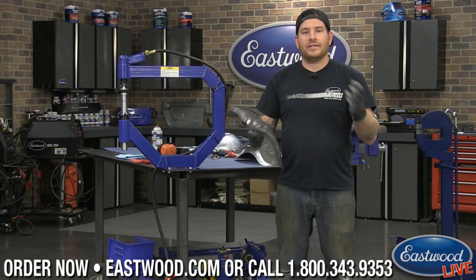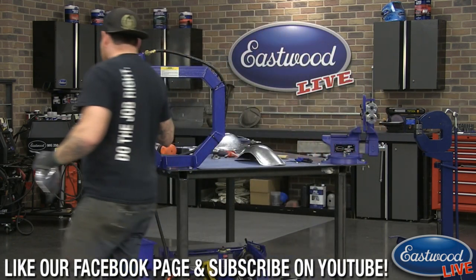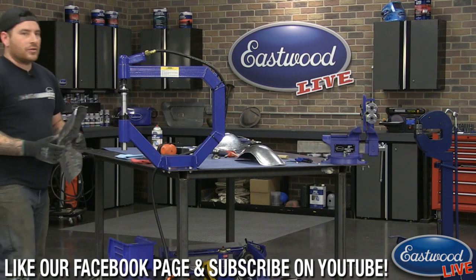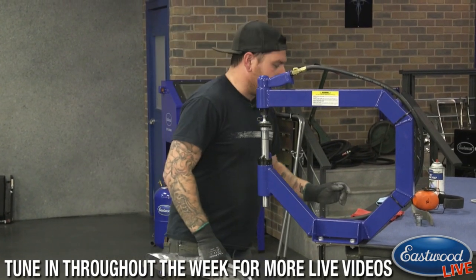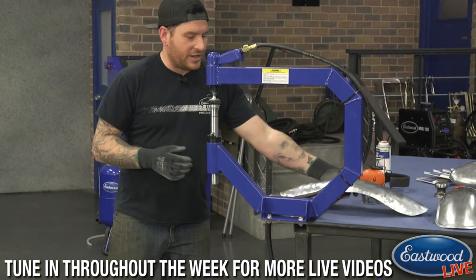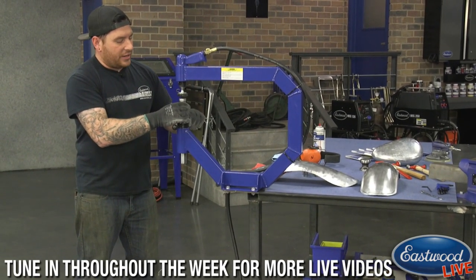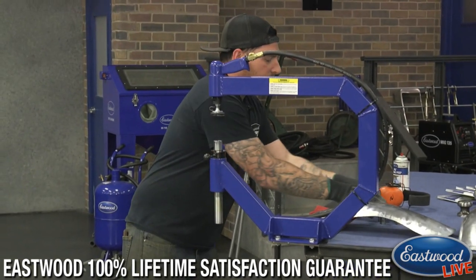Because the wheel's so wide, that causes a problem. So what I like to do, and also to speed things up, is go over to the planishing hammer here. The planishing hammer will allow us to smooth in the piece. What it does is it has a pneumatic air hammer here on the top, and it has a die in the bottom.